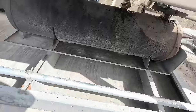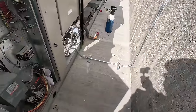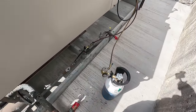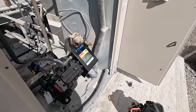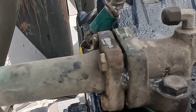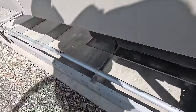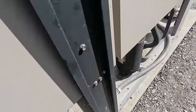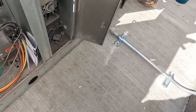We're looking for big stuff. When I come back and they actually got everything hooked up, I'll do a full-fledged pressure test. They're going to pressure test the evaporators separate from the system as well when they get those taken down. Found one leak — right on the discharge. That ain't good. You wouldn't think it worked, but you give it long enough, it'll show up. Don't really see anything on any of that. We did get the contactor replaced — got its date on it, everything's cranked in. Electricians have got that part done, new conduit ran.